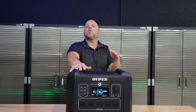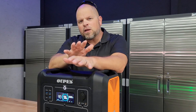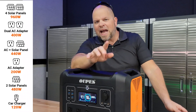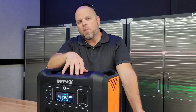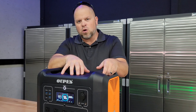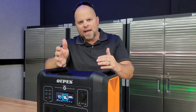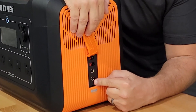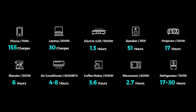There are several ways to charge this up: solar panels, the AC adapters, or charging in your car. Something I found a bit confusing — the documentation shows four solar panels up to 960 watts, which I believe is specific to Opus solar panels, while the unit is capable of up to 1,000 watts of solar input total. You can also combine AC and solar simultaneously, run two solar inputs at once, or use two charging bricks at the same time.